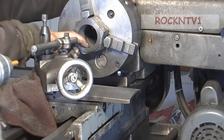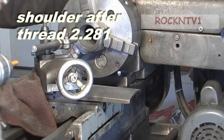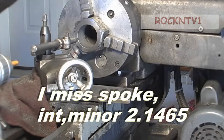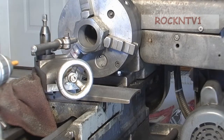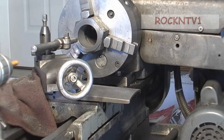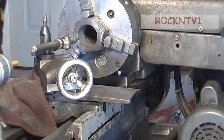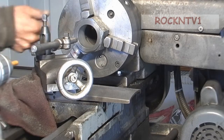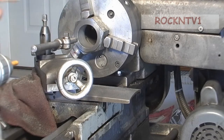We know that the shoulder finishes on the spindle at just under two and a quarter - 2.248 or whatever I measure that spindle at. And like I've said in the past, measuring anything under half a thousandth with homeowner tools is likely going to be in the neighborhood of the fudge factor. I can read half a thousandth, but you're talking about feel in this direction, feel in that direction, if you're using snap gauges or whatever. Even if you had a direct-reading bore gauge that was certified by a tool guild, then you could be splitting the tenths.